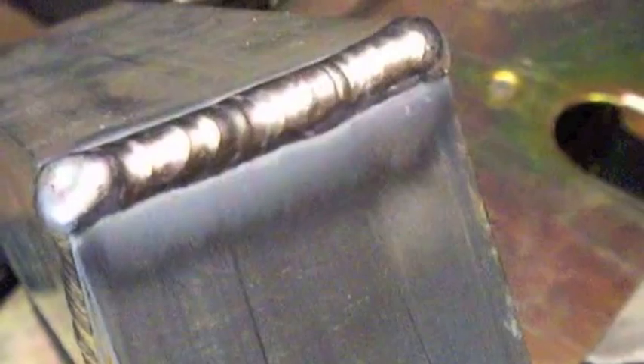Just a side note — mainly we're trying to talk about properties of aluminum as we work through this. You need good shielding when you're welding up on an edge like this; sometimes it splits your gas. I've got this electrode extended a little bit too far. I've got a gas lens electrode, and you need a gas lens if you're going to extend the electrode out that far. A gas lens isn't always necessary — some people like them — but if you're going to extend the electrode out, a gas lens is going to help you push that gas out there softer.